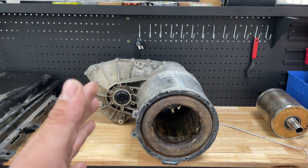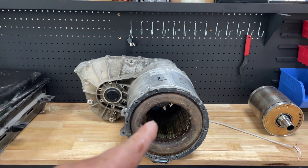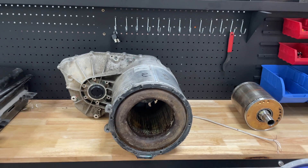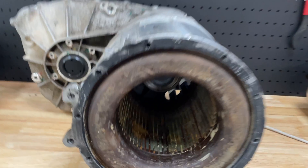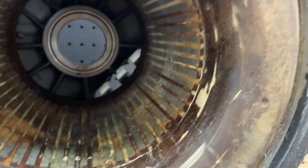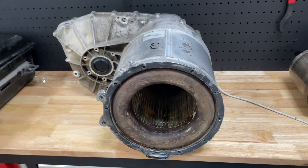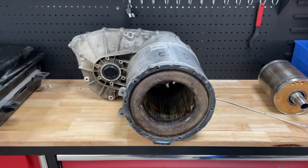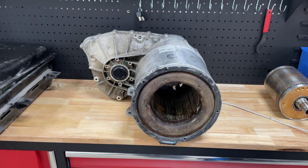We redesigned the coolant flow, the coolant seal, and we redesigned the drain for the coolant so that if it gets inside it shouldn't touch the stator. You can see how the damaged stator looks after water ingress — it's unrepairable. We tried cooking the stator for three hours at 100 degrees, then 200 degrees, but still had issues with isolation.